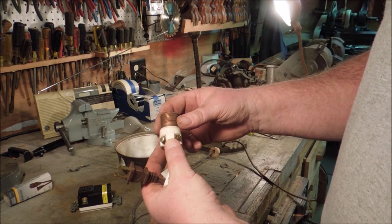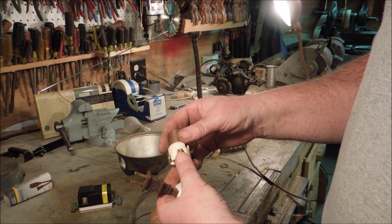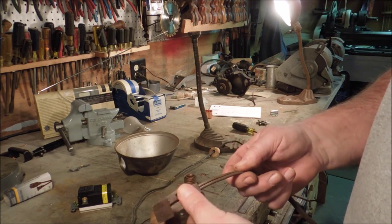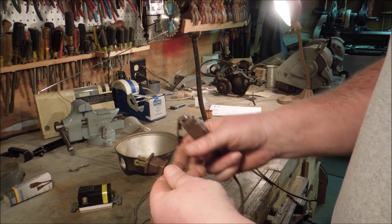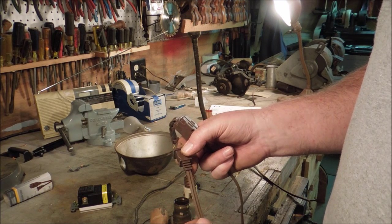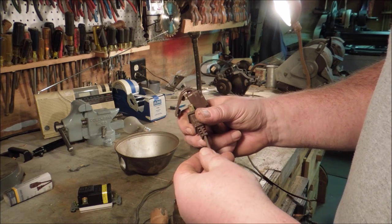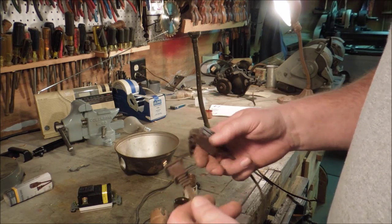This socket is polarized the same way: the white wire goes on to the silver screw, the black wire goes on to the brass screw. Now this extension cord doesn't have any polarization marked on the wires — neither one is marked white or black. But you can follow along the zip cord. The wide blade goes on this side of the wire, and that is the neutral side. If you look on the side of the zip cord, this one has ribs on the side of the neutral wire, and it's smooth on the side of the black wire, or power wire. There — so we can track that down.